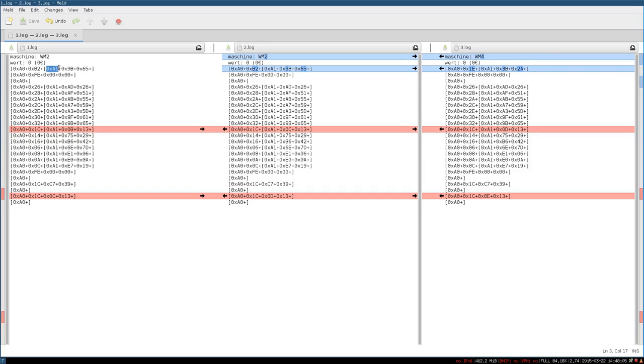In this transaction, you see again that it selects the slave by using the address A0, and at the end it writes a 1 to read the data. The device ACKs it, the slave sends the data, the master acknowledges it, the slave sends the data, the master acknowledges it, and the master sends a stop condition. And this is one transaction, and you can see the same syntax all over the place.